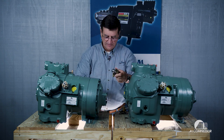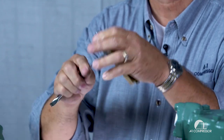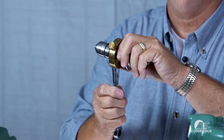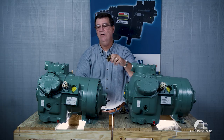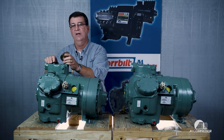It is spring loaded, and the way you do it is you just pull the spring out like this and install a half inch wrench inside of there. You may have to put it in a vise or on a pair of channel locks, but you unscrew this unloader piston off of the bottom of the unloader, and then you have an unloader that will fit into the new suction shutoff unloader head.